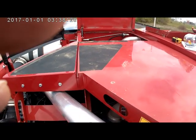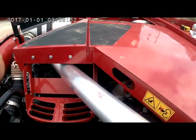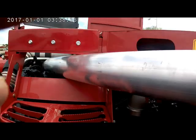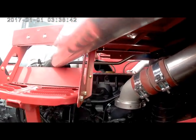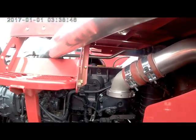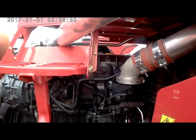So that's the difference between the air routing on a 9240 and an 8240. Either one will work — it's just this last route over the engine that we had to do a little bit differently. In both cases, we'll clear the oil fill cap back here so that you can still use that to put your oil in the engine on top of the valve cover.